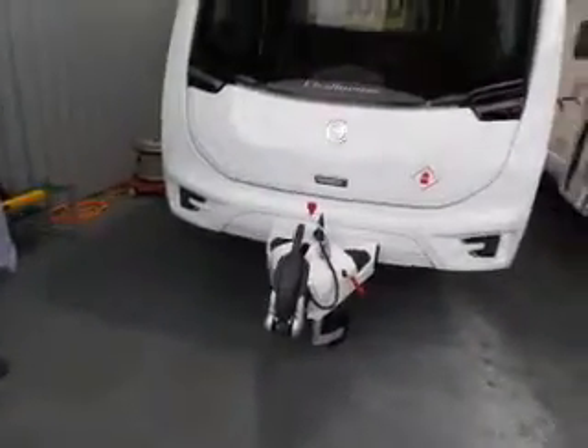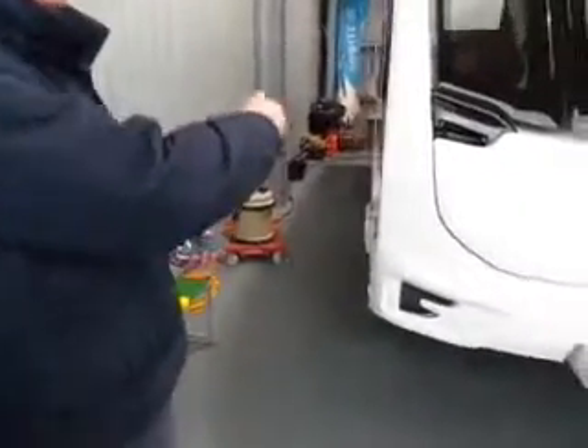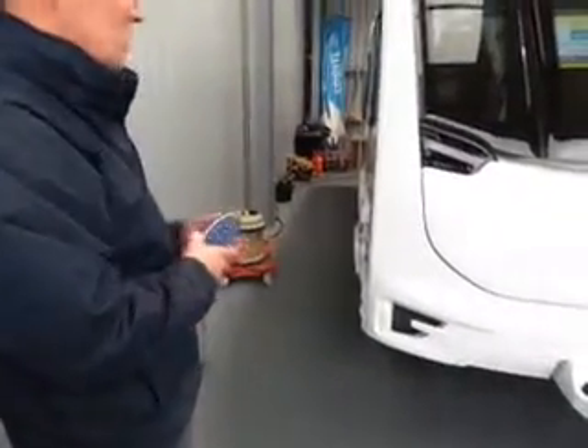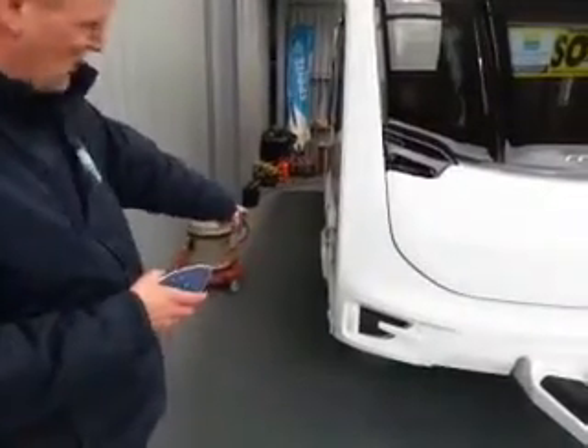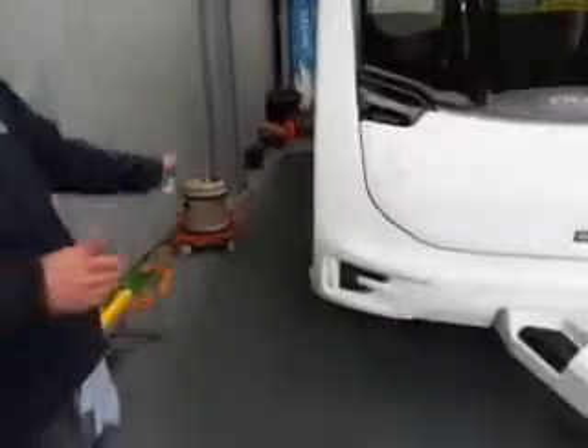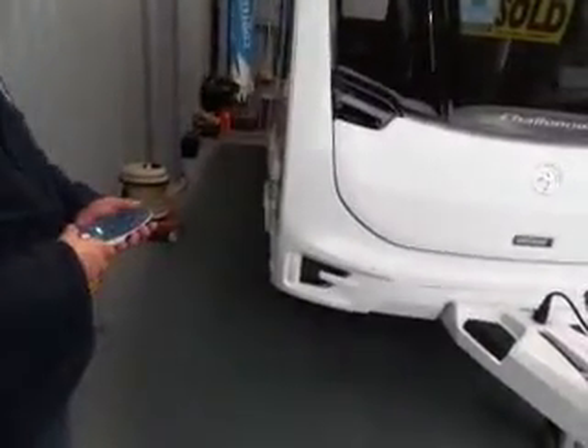One thing to mention: you need to open the battery box to turn the key. If you're going over rough ground, make sure you shut the battery box lid. If it's open and you go over a curb and catch the lid, you'll rip the whole battery box as the door will snap the hinges off the back.